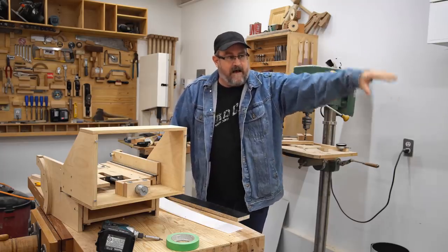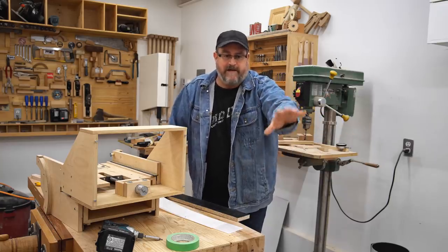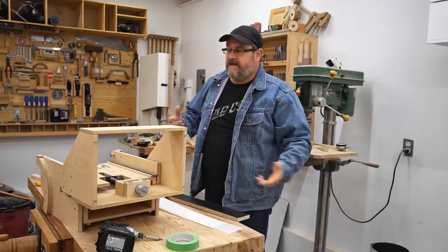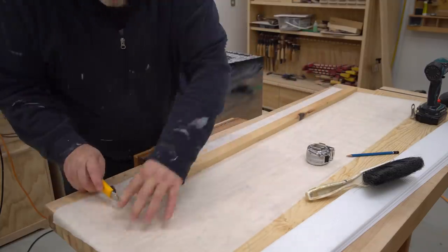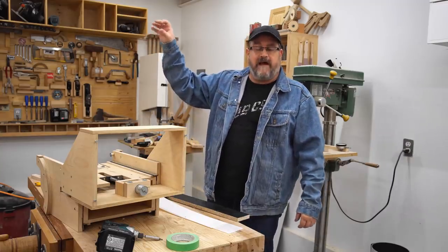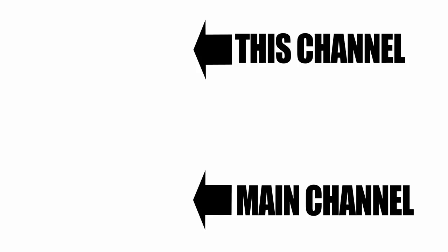As for the diffuser problem and the directivity of light — I've got six down at this end that are all uncovered. I don't mind the shadows down there over the table saw. I left the ones up in the ceiling so I wouldn't get any glare down on the table saw. For the ones on either side, what I'm going to do when I get another box of it is cover them with parchment paper — culinary parchment paper. I cut it to length and width, tape it into a tube, and slip it over the fixture. It gives exactly the right amount of diffusion without changing the color of the light, and it lets all the light through so you're not dimming it unnecessarily.